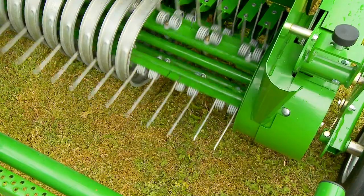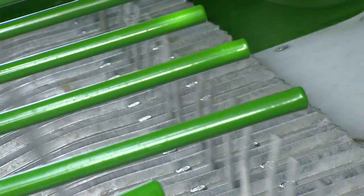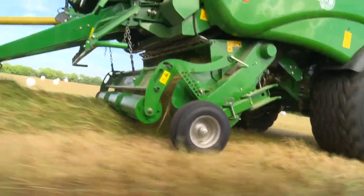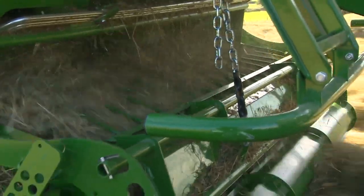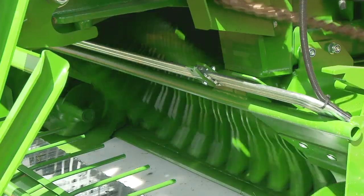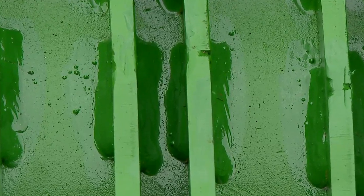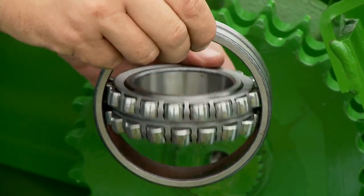The Fusion Vario is fitted with a five-tine bar galvanized high intake pickup system. A high-output crop compression roller helps to level out uneven swaths and optimizes baler throughput. As crop passes through the high-capacity pickup, it moves through to the feed rotor. The feed rotor or chopping unit boasts a heavy-duty rotor and comb. The rotor on all Fusion Vario machines is welded on both sides for superior strength, and on the drive side the rotor is fitted with a double-row bearing with a long service life.